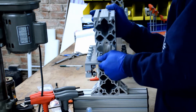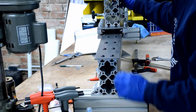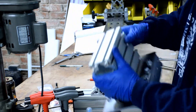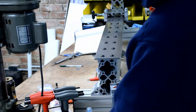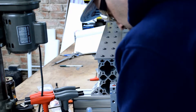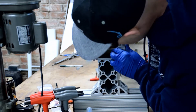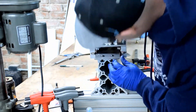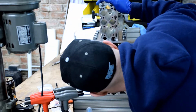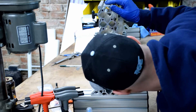After I do my adjustment, I put the tailstock back on the ways and check my work. It's a bit of a process — you may have to spend some time getting this one right, but it's an important step. It's typically the bottom bolts that produce the binding and need to be adjusted. If all goes well, you shouldn't have any binding, and you can move on to the steps where we tighten everything down.